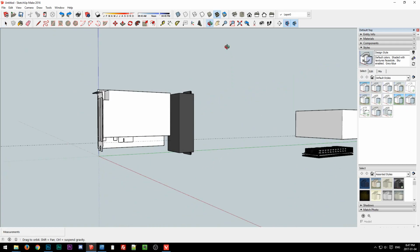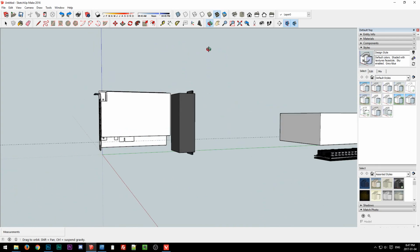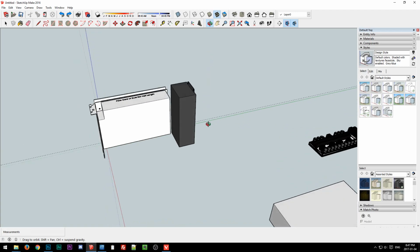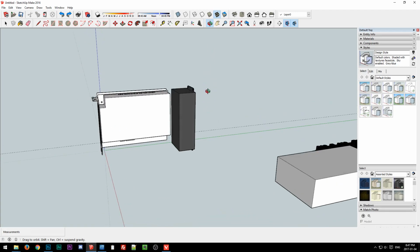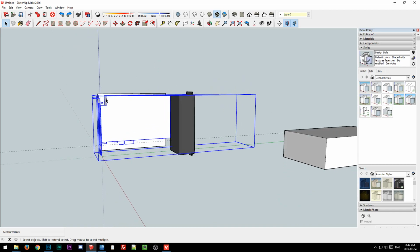The only issue with that is, where do we put the HD Plex, the DC-ATX unit? This is the reference height for the video card, which we all know video cards rarely end up at. They're almost always taller. Either the heatsink's taller, or the shroud's taller, or both, or the worst one is when the video connector is not recessed, so it ends up here, which doesn't seem that bad, but then you have to have room for the cables, so then you end up here.